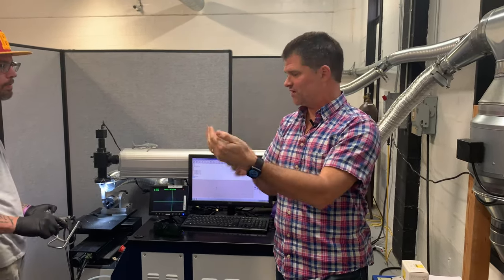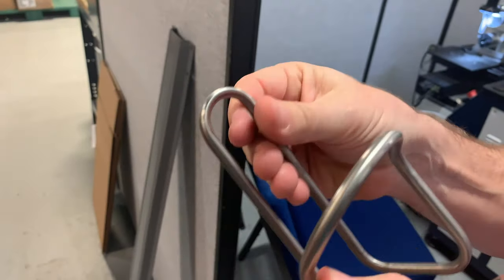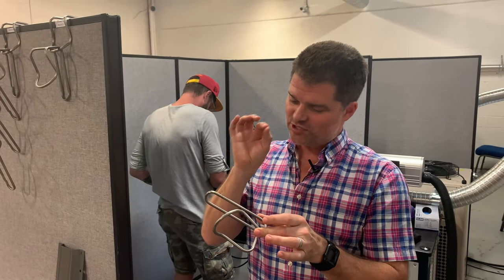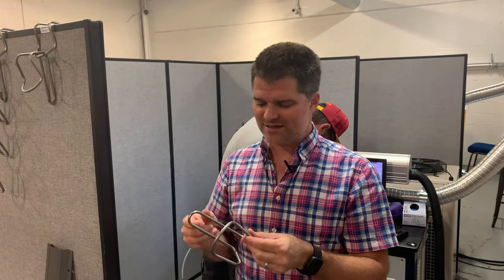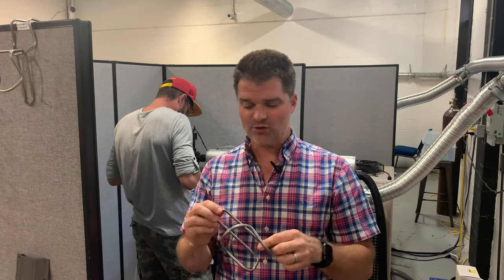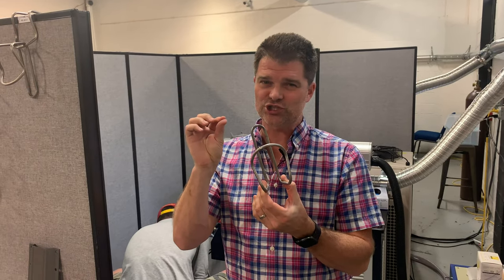One of the great advantages of laser welding is that there's so little heat put in, and it's put in so specifically, that there's almost no heat-affected zone — probably somewhere in the order of 0.1 to 0.2 millimeters, very shallow. You can pull the part right out and touch it with your bare hands almost immediately. This tubing has a 0.3 millimeter wall thickness — that's about four sheets of copy paper thick — and we're welding it to 99% depth, plus or minus one or two percent. Incredible precision.